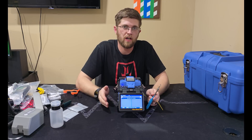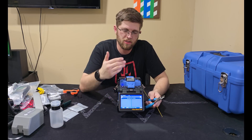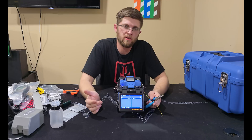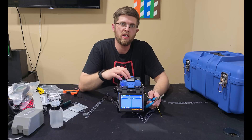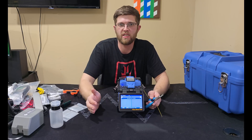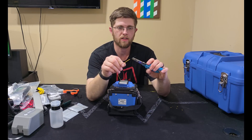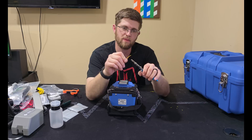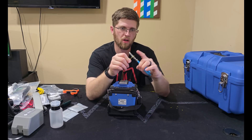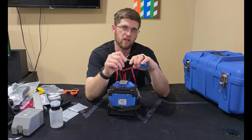When you turn this on it'll ask if you've done a calibration yet. I hit no and it has you load two fibers to calibrate — it's always good to calibrate your fusion splicer, especially if you're doing a lot of splicing that day. When stripping the yellow outer coating back, always do little pieces at a time. If you try to do too much at once and pull it off, it'll just break the fiber.